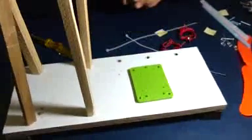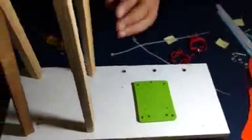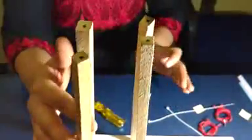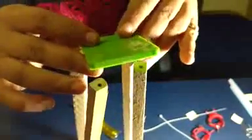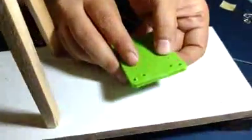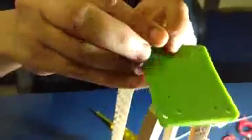After doing this, this is the plastic base which you will be mounting on these 4 pieces. To do this, the batten should not be very tight — it should be loose enough so that they can be easily clubbed onto the plastic base. These are the 2 holes from where the motor will get fitted, and these 2 holes should face front. Fix this plastic base on the 4 wooden battens using 4 screws.